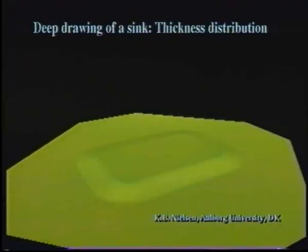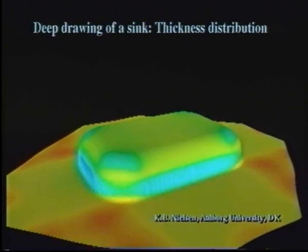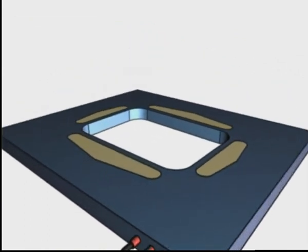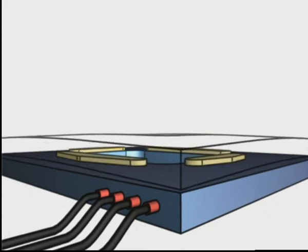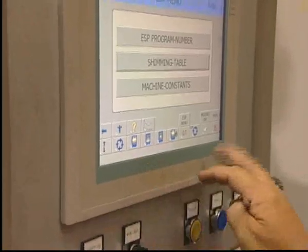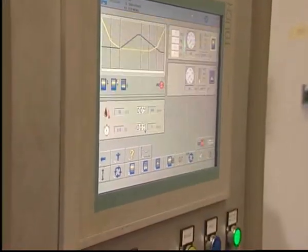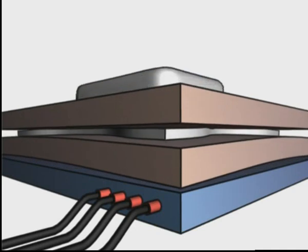Based on detailed studies on the way blanks flow inside the press during the deep drawing process, Hydraulico has developed the electronic shimming plate, which allows for extremely precise control of the blank holder pressure on the blank. Hydraulico's electronic shimming plate is a tool that is mounted directly under the blank holder ring. The shimming plate is connected to a control system that takes care of the action during deep drawing, compensating effectively for the deflection of the press frame while the process runs.